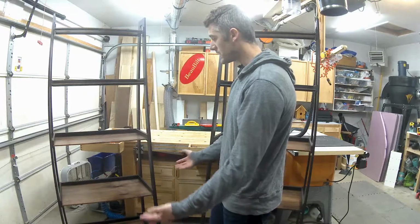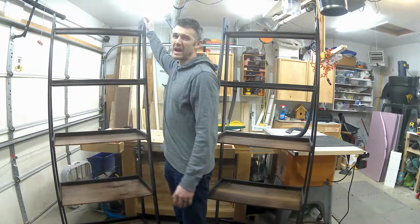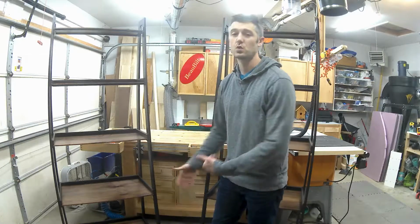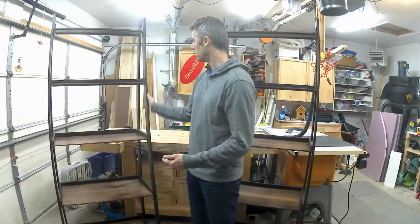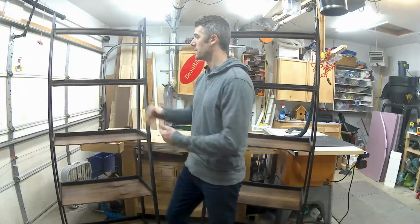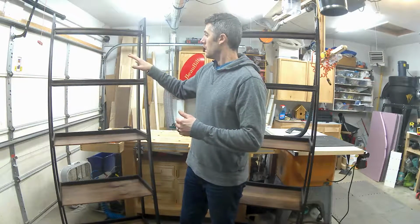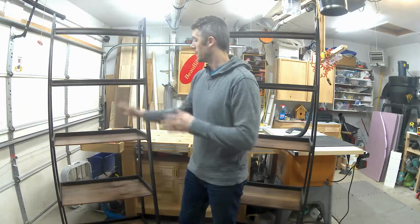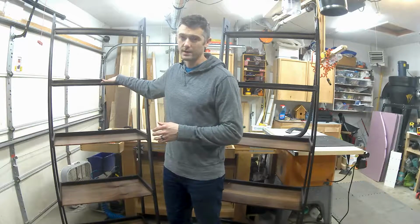So, give you an idea. This is 29 inches wide. It's about 84 inches tall, and at the bottom, the lower shelf is 20 inches deep. It's primarily constructed out of maple, which makes up the A-frames on the side. The maple also makes up the shelf supports and the lower stretcher in the bottom. The shelf panels themselves are made from walnut, excuse me.